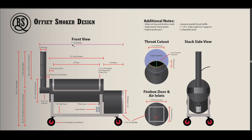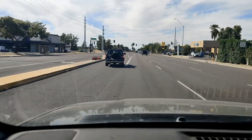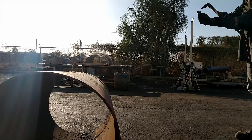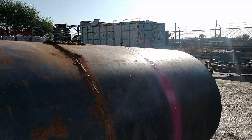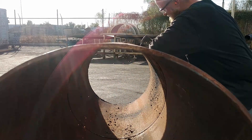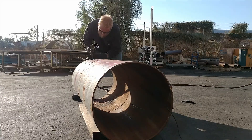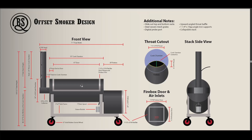Overall width is 7 foot 1 inch. Overall height is 6 foot 4 and a half. Now this cook chamber and firebox all came from one pipe. We loaded it up into Lauren's truck and he took it down to his work and cut it down with a torch. He cut me off a 20 inch firebox and then cut the door opening, leaving just a few tabs for transport. We got advice over on smokerbuilder.com to cut it all the way off and then make adjustments to the door. So he left me with a 20 inch firebox and 55 inch cook chamber.